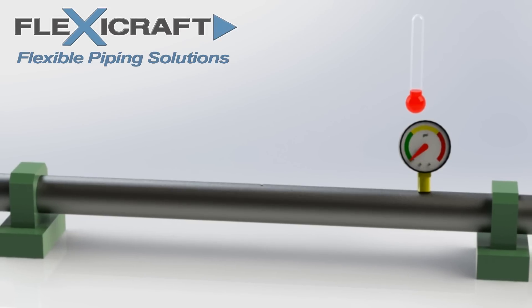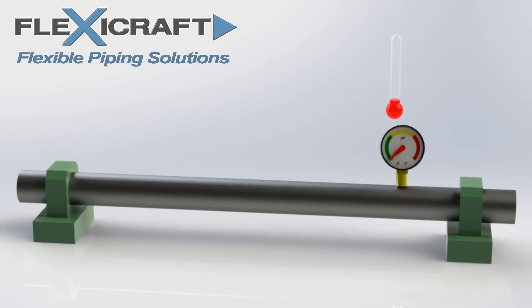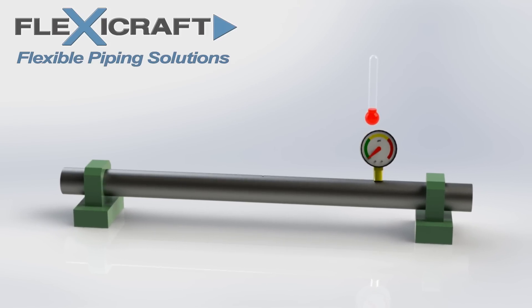Metal joints are primarily needed for thermal expansion of piping. If straight pipe sections between pipe anchors expand without added flexibility, the loads on the anchors will likely be too much for the system to withstand. We see here a model of a pipe run with anchors on either end. Note that the anchors are shown close together just for visualization here, but in any real system they would be very far apart.